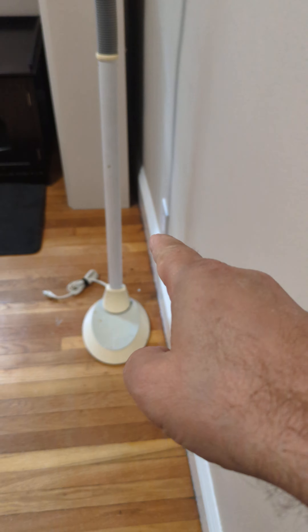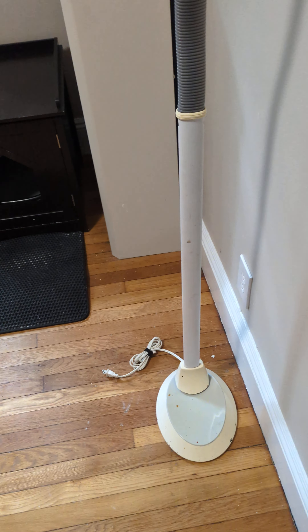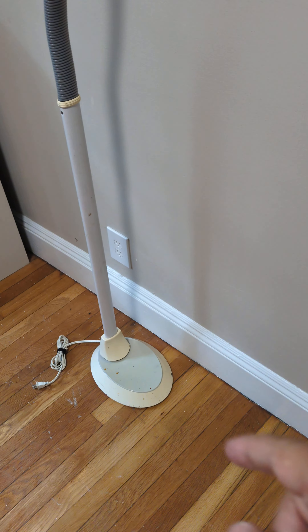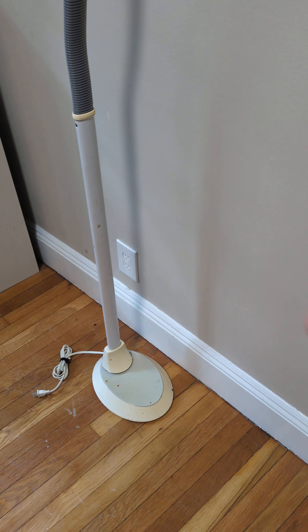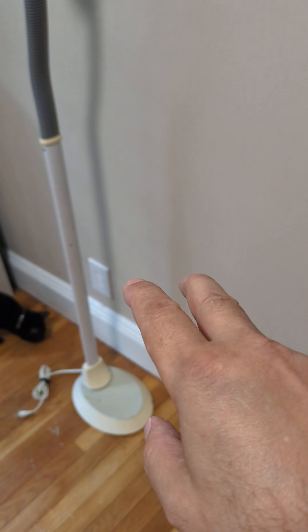So that's what I know about the troubleshoot. What I did do is I opened them up — you're going to find them without electrical tape. I know you're going to come back in here anyway. I did open them up and I did check. I took the lines off and checked them direct to see if I was getting 120 just from the lines, and it wasn't the outlet.